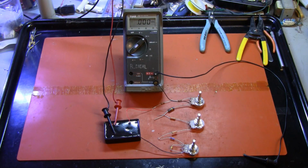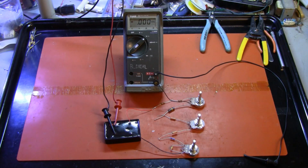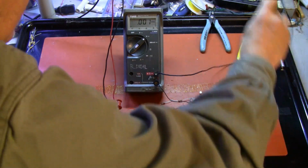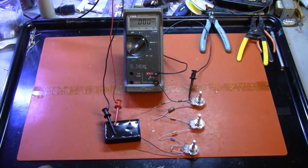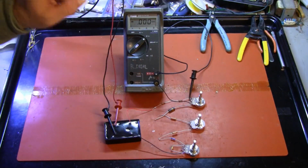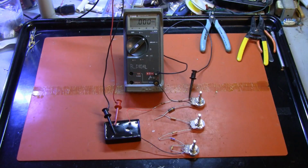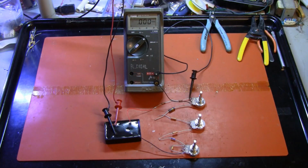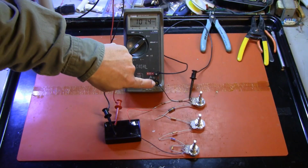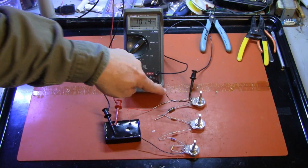So the first thing we will do is set the voltage at the top of the, I can't remember the name of it, the shading control, to the indicated 100 volts. So we turn on our power supply and our meter says 101 volts. Considering these are 5% resistors, I'd say that is pretty accurate.